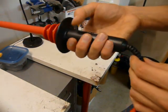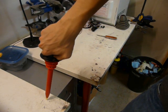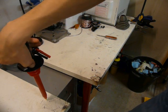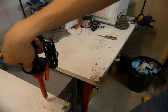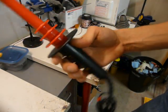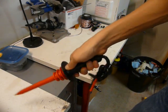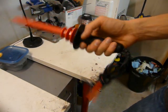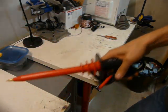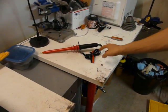Ideally what you'll do is hook this up with a clamp or something like that, with the circuit de-energized, set up everything, and then leave it and turn on the power remotely for maximum safety. Because you can go around and poke stuff like this, but if you dislodge that ground, it can get a bit scary. Anyway, that's for another day. I'm not going to use it right now.